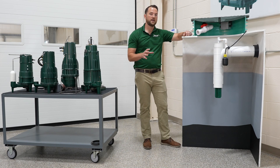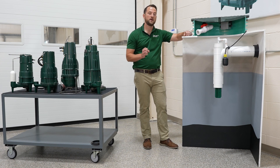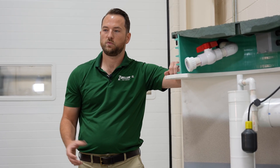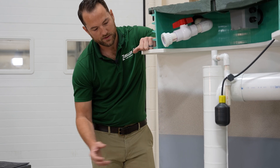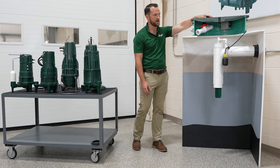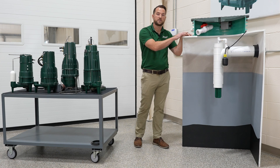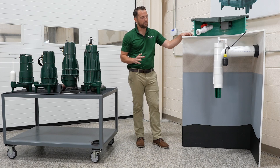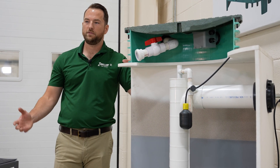What many people don't realize is that your drain field is also a treatment system — the soils treat the remaining 50% of the water. Sending solids, fats, oils, and greases to the drain field can plug the soil, leading to a failed drain field, which can be a very costly repair. Using solids handling pumps, or ideally gravity flow into your septic tank, maintains those separations and prevents solids from reaching the drain field. If your effluent pump is clogging, do not replace it with a grinder pump — address the issue upstream, because grinding those solids and sending them directly to the drain field will lead to a plugged field and effluent ponding.